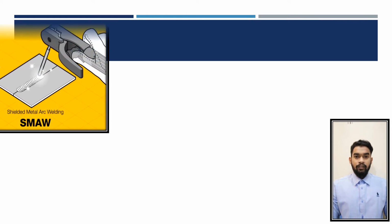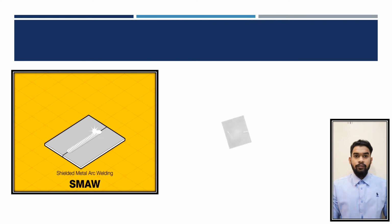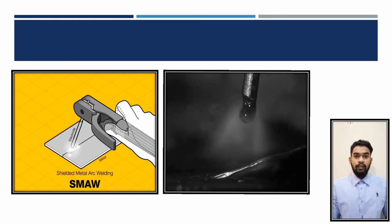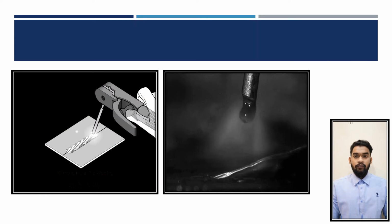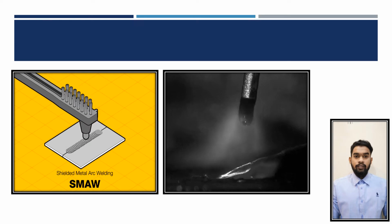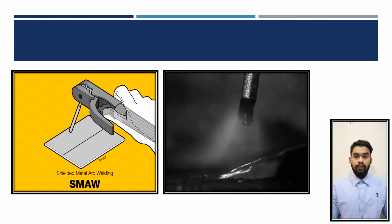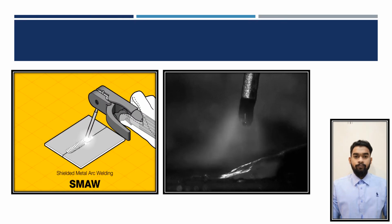You want to make a smooth, clean weld during welding. To make this procedure easier, use steel that is compatible with SMAW welding processes. After you have chosen your steel, make sure to tidy off the edges for a nice weld. This includes the removal of paint, corrosion, dampness, scales, and oil. If you can't clean the joint, it's going to be a problem.